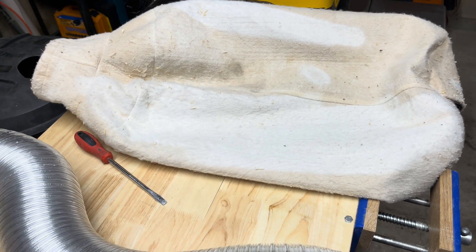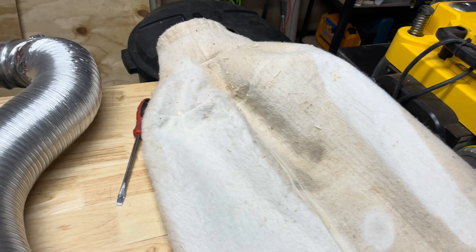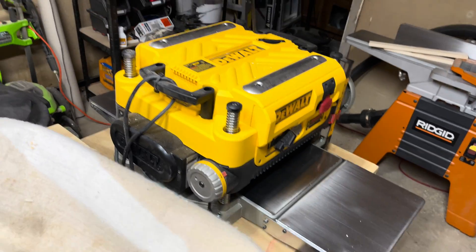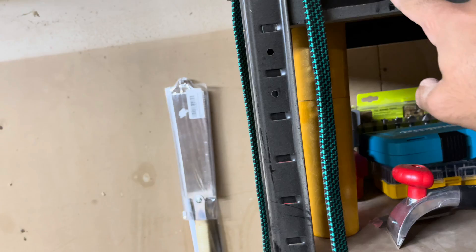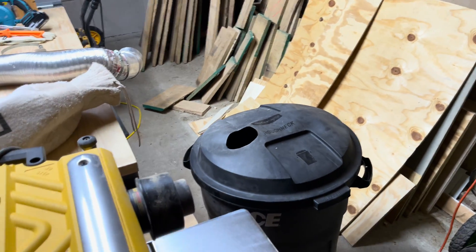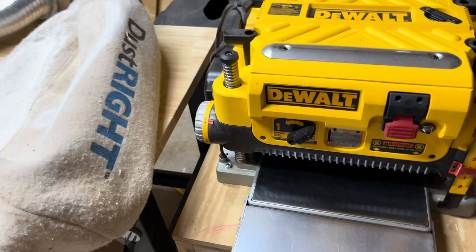So that's a quick little demonstration on how much dust is actually on this bag. And again, it's a 30-micron bag, but even if you have a five-micron bag, these dust particles are oftentimes even smaller than five micron. So I was tired of the dust being everywhere. I mean, you can look at this and see how dusty this is — it's right behind my planer, and that's all sawdust from where I just had the bag catching the chips. So I wanted to find a better solution.